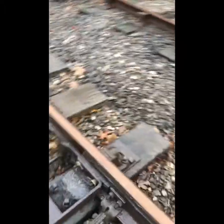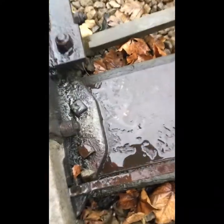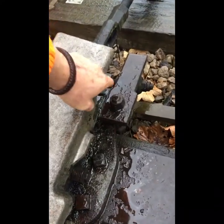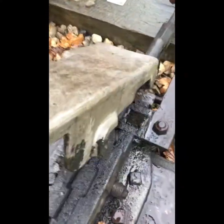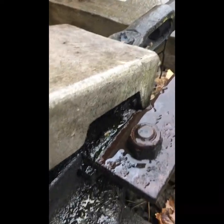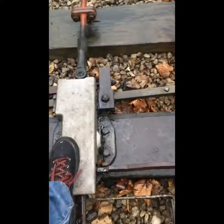There are insulated bushes — and one thing to mention: there are also insulated bushes on the switching extension pieces; these are rubber. Regarding the detector cover: it's quite important to get this right, because if put on the wrong way round, it actually jams the kicker from coming undone. You can move the points, but you won't be able to move the kicker and you'll end up with a detection fault. It goes on with the back legs underneath, lines up, and when in place — gently — it snips down and locks in place.